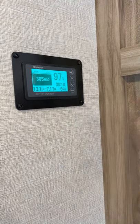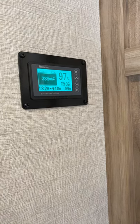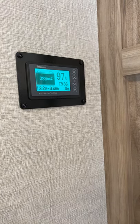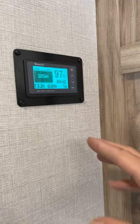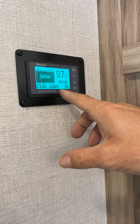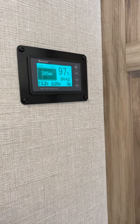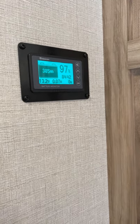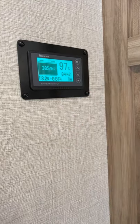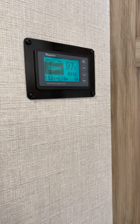We're seeing fluctuations because the sun's changing and the refrigerator, which is DC, is drawing power right now trying to cool down because we just set this unit out. So we're right at about zero — we're actually charging now and then. We're producing as much power from the solar panels. That looks correct. We're in a plus, which shows me that the solar panels are actually charging and everything's hooked up right.